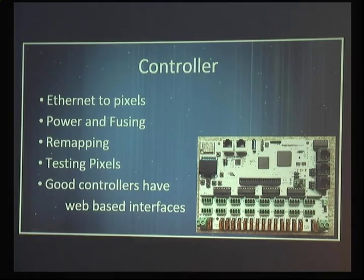As the PC spits out the streaming Ethernet protocol, it goes to a controller board that takes in Ethernet, converts the protocols, and drives the LEDs through green connectors in parallel. The microcontroller on the board handles all the conversions. An important piece is the fusing — standard car blade fuses along the bottom. The LEDs run at 5 and 12 volts DC but can draw substantial current, and I've seen people online have accidents that melted things down and even started fires. Don't skip the fusing.